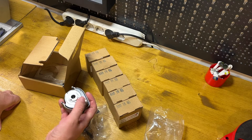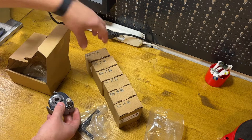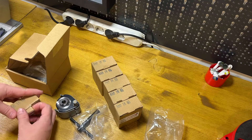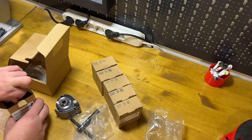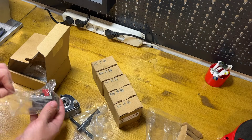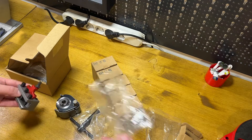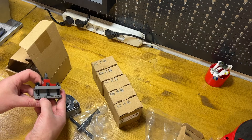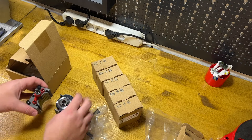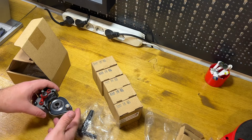I stopped exactly on this model. Why? Because of the size. The size is a little bit different compared to what is in the line of the original Multifix, and of course pricing — pricing is important. So these are the size for the tool holders: 1665. I could use cutters up to 16 millimeters on my small lathe. Let's see how good it will be and how good this tool is to use.